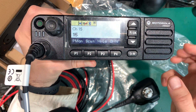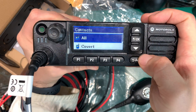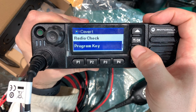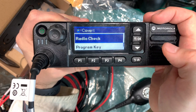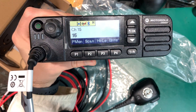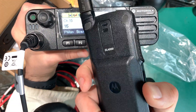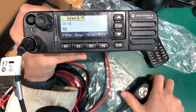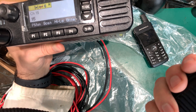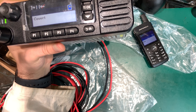In the contacts list we've got no problem calling an alert — we can do a radio check and the radio is working just fine. I just pinged the Motorola SL4000. We are dummy loaded, so let's try to transmit in close proximity: testing, testing, one two three four five, radio check.